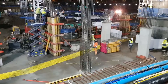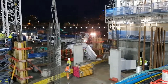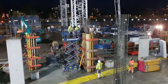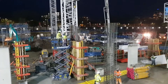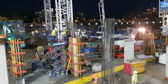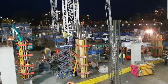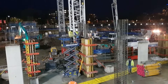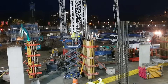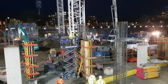As I thought, the guys are going to be using the pump to pour the walls and the columns. It's already getting dark. You can see they're using the scissor lift for it — they've got the poker there and they're just starting now. I hope you can hear the concrete going down. They've started the vibration — vibrating the concrete now, you can hear it.